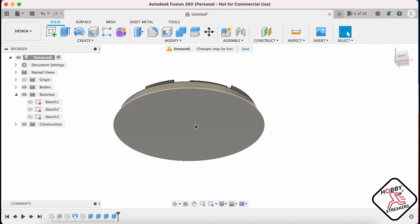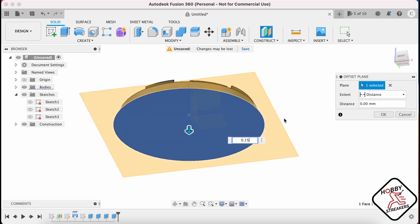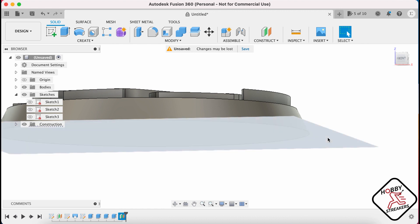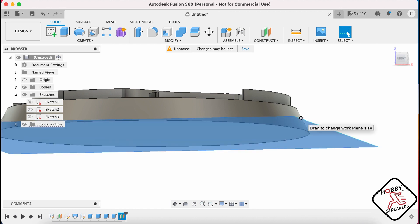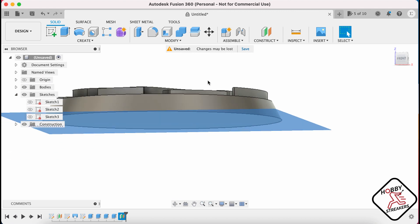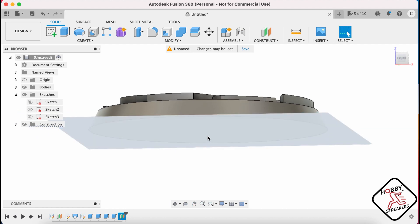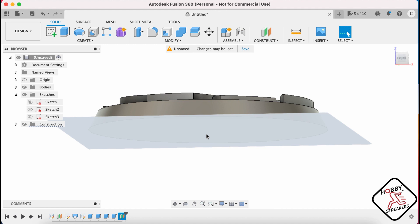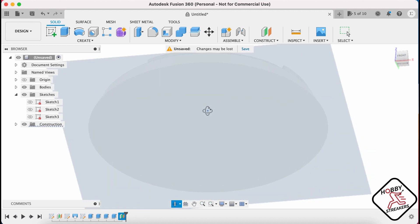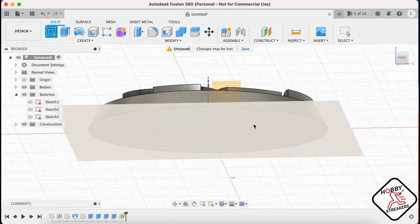This plane is at 0.15mm. The reason for 0.15 is because I have my layer height at 0.025mm for my resin printer. The first five layers that it's gonna do are gonna be 0.125mm. I try to increase that for one more layer. What we will want to do is create a foot for that base that basically will take into account the elephant foot when you print something — it tends to spread across. So what you would want to do is create a sketch on that plane.